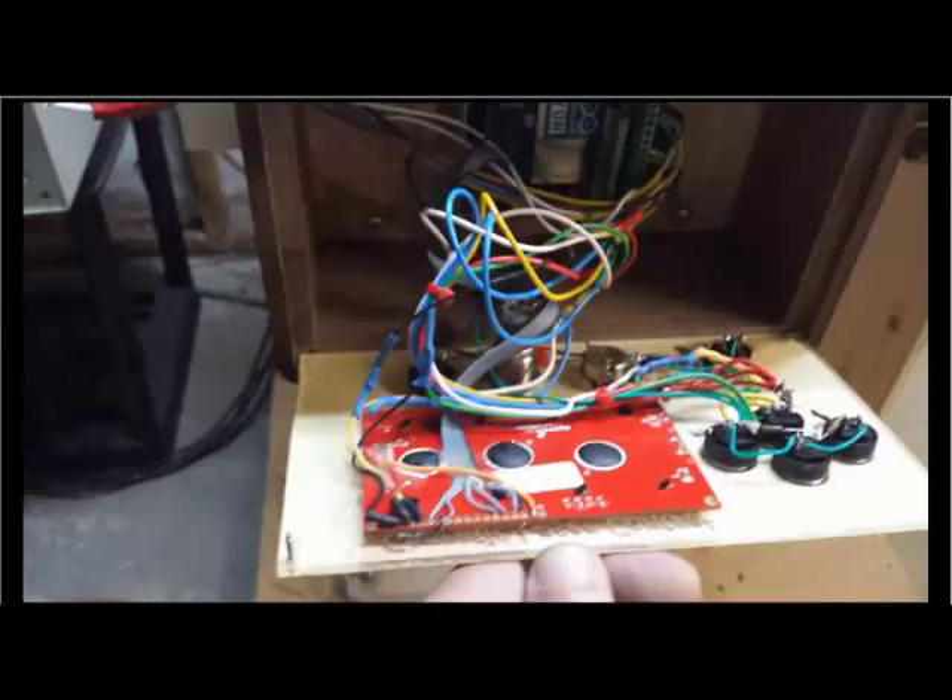The Arduino has lots of pins, so using those six pins is no big deal. Here are our four selection buttons, and you can see it's basically a matter of soldering a resistor between each of the buttons and leading one wire back to the Arduino. Because the Arduino can read analog voltages, it only requires one pin to read all four of these buttons.